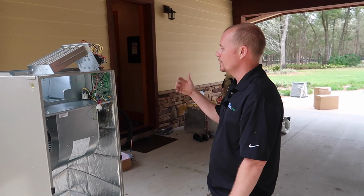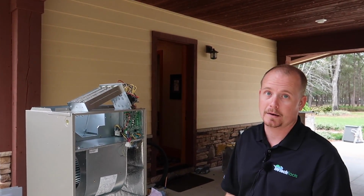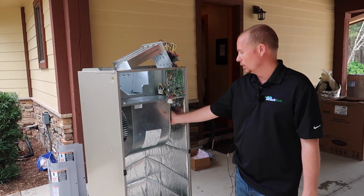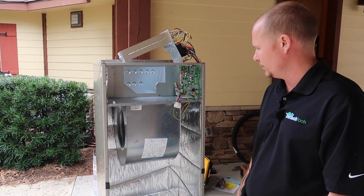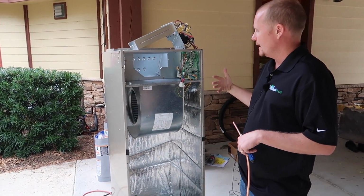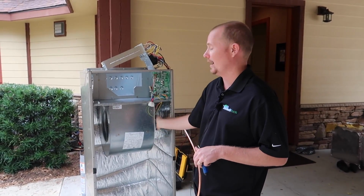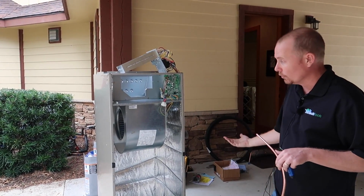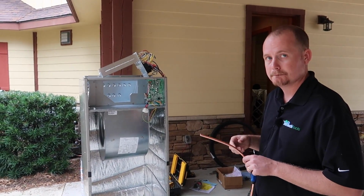You know, surprisingly though, this technology with the inverter technology makes heat pumps more viable. You're actually starting to see them creep up north. So this is a totally variable blower as well, which you had before. They were actually similar technology to what you have now. But this board communicates. This is a fully communicating system, so it's not using just switching. It's actually talking to the thermostat, talking to the condenser in order to decide what the fan speed should be to maintain optimal capacity and dehumidification.